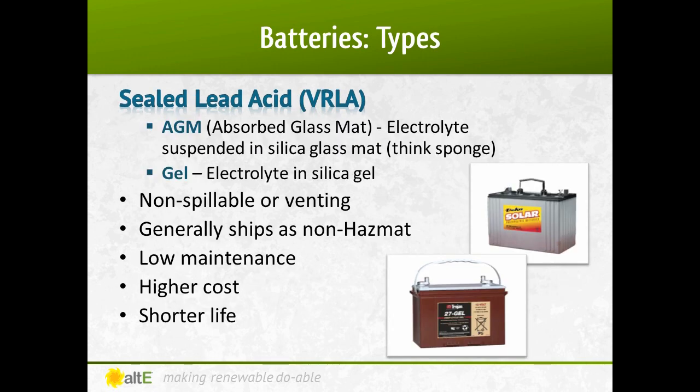Sealed lead acid batteries are most commonly available as either AGM or gel — this refers to the form of electrolyte inside. An AGM battery has the electrolyte in a spongy mat, and gel batteries have a thicker gel that keeps itself distributed within the battery. There are pros and cons to each design, but in general both types of sealed batteries are very similar and good. The biggest pro of sealed batteries is that since they are sealed, they won't spill or outgas, making them a safer option than flooded batteries. They also don't require monthly maintenance — just occasionally inspect them to see that they look to be in good shape. Sealed batteries are an excellent choice for battery backup systems that aren't charged and discharged every day but require a long standby period. They also do better in extreme cold. The downside is that they tend to be more expensive than a flooded battery and have a shorter life than a well-maintained flooded battery. But if you are not able or willing to maintain a flooded battery, sealed is definitely the way to go.